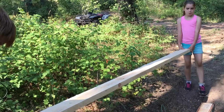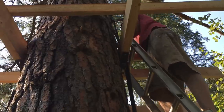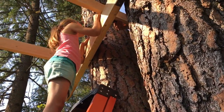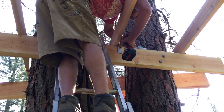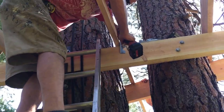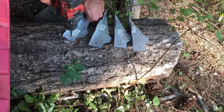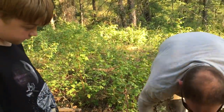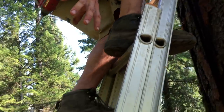The joists went on. I just sort of threw them up there, tried to get them situated so it's going to be somewhat symmetrical on our two beams that are not entirely parallel to one another. I used some homemade hurricane clips to attach them — just little L-braces I had reclaimed off of a deck that I tore apart for somebody. I cut corners off to act like hurricane clips. That all went up pretty easily.